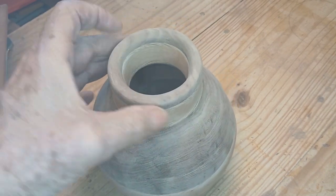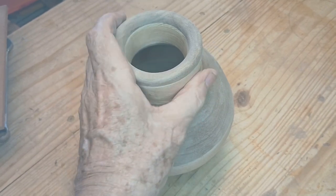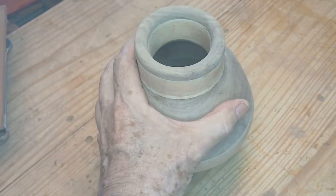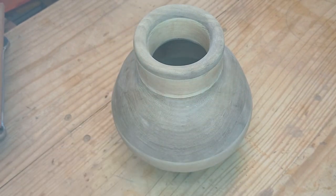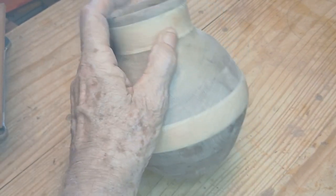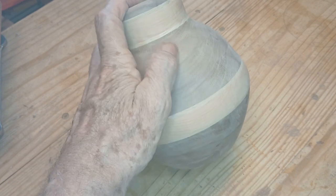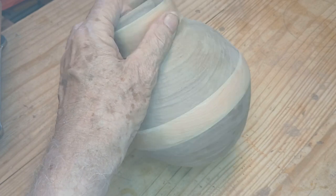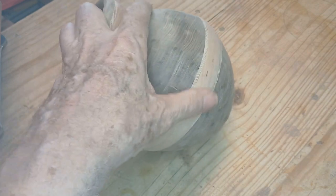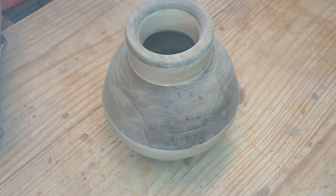I think I've got it the way I want it. Doesn't look like much without a finish on it, but I've got the shape where I want it and most of the sanding scratches smoothed off, things rounded off. So I'm going to put a quick coat of finish — I'm going to mix some poly with a little bit of mineral spirits and thin it down and wipe it on. It feels really good, nice and smooth. I'm hoping it'll bring this cherry out a little better so I'll get more contrast between it and the little eighth-inch veneer on either side. I would have used a darker wood, but I just didn't have it. I may revisit this later with some mahogany.